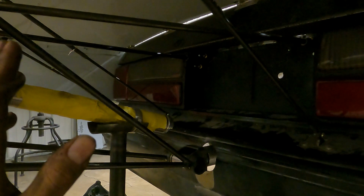This is the piece we welded last night, this square tubing. And then we have all of these support rods that run down to here. One runs back to here, that will be bolted. This will be bolted up here with like a 10-32 screw and nut. That way we can take the whole chute mount off without having to unbolt those 3-bolt flanges. But yeah, basically just working on connecting everything in there, making it strong. So yeah, nothing too complicated. I've almost got it done.